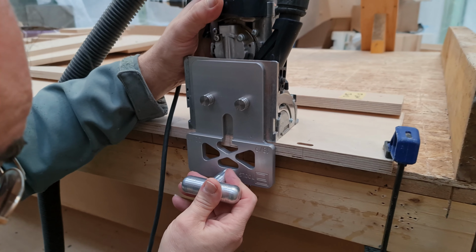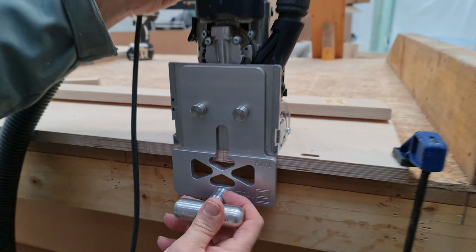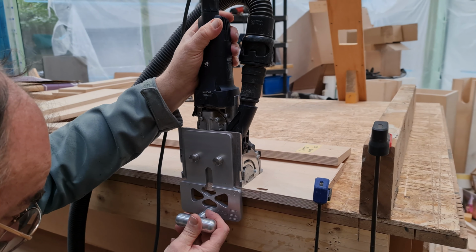Here is where the stool comes in, as it allows your eye line to be right in front of the marks and you are comfortable and balanced rather than struggling by leaning over, reducing your precision and possibly introducing parallax measuring errors. The dominoes are drilled all with the narrow settings and, importantly, done slowly with patience so as not to chop up the surface of the plywood.